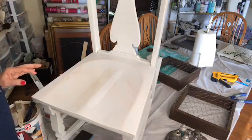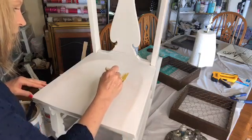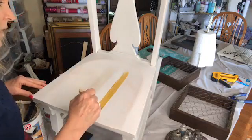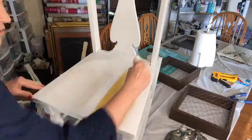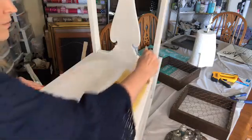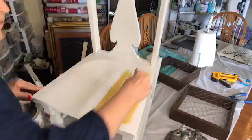So I'm going to use the shellac here at the end, and there's not very much there, but I'm going to squeeze it in here, right there. And they'll do the whole piece in shellac. So there's a little bit of pink over here, clear over to here. So I'm just going to go ahead and do all of this and see if we can't keep the pink from bleeding through. Okay, again, you clean the shellac with ammonia.